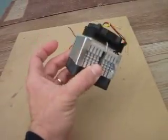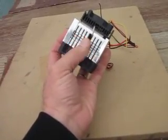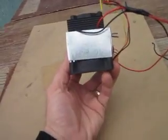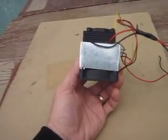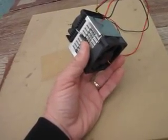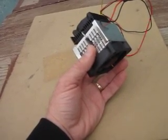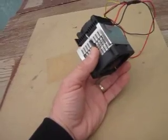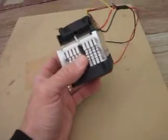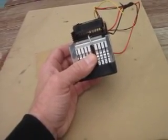What I have made is I took a heat sink off of like an AMD processor. This is the side that has the least airflow, and I baffled with pieces of sheet metal the side that has the highest airflow. By the way, you can use a computer power supply and it works, but you have to regulate the amperage. It will max out as much as this thing can take and you will blow your device. You have to regulate the amperage — it'll blow your device, it'll probably blow your power supply.